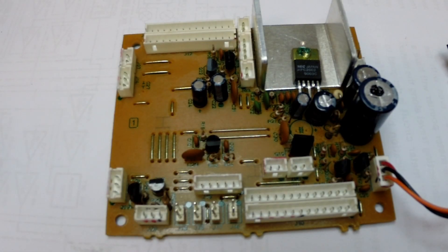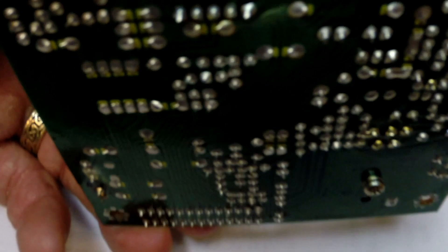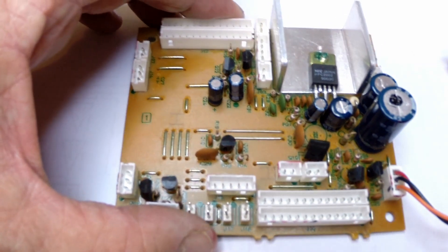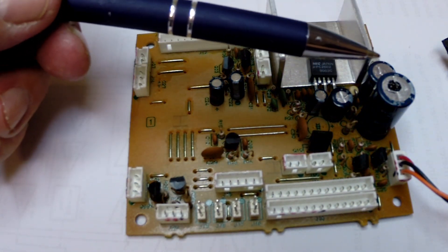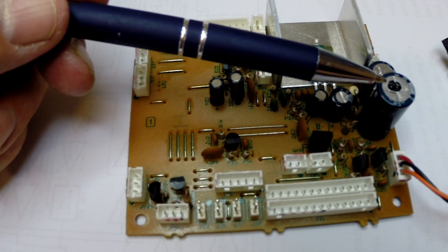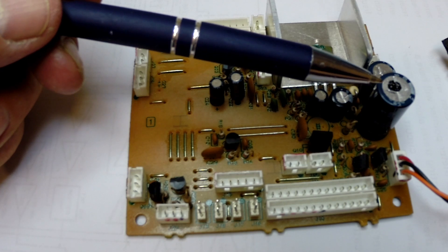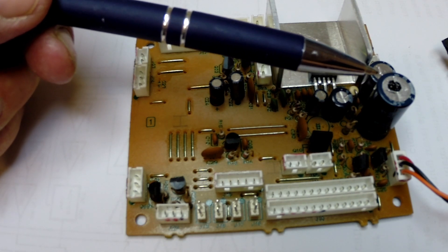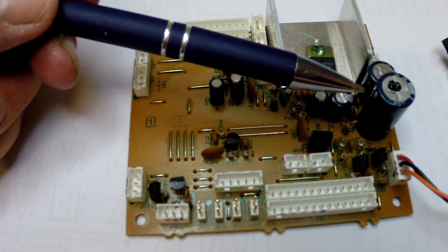This is the F2887103 AF unit — the faulty board that has been recovered from the FT736R transceiver. There are no obvious signs of stressed or faulty components, no sign of heating. On the reverse side of the board, same story — looks very clean, no signs of obvious heating or stress. I believe the C20 2200 microfarad electrolytic capacitor is a likely candidate, consistent with the age of the radio — it's a known fault with power supply electrolytics becoming leaky and causing problems.